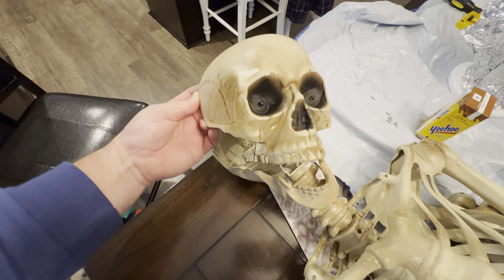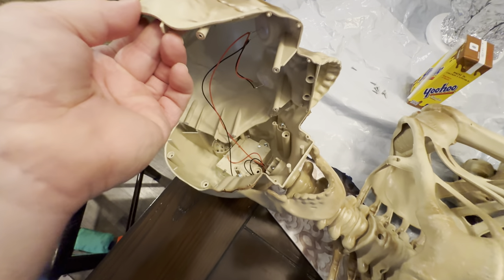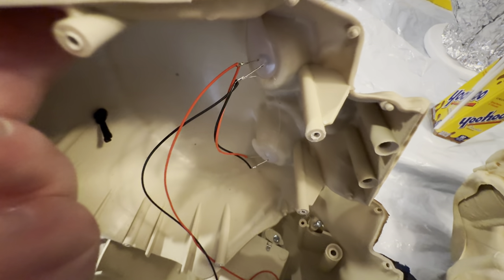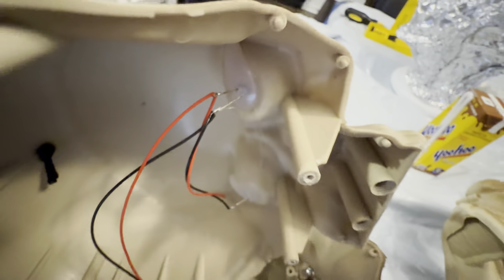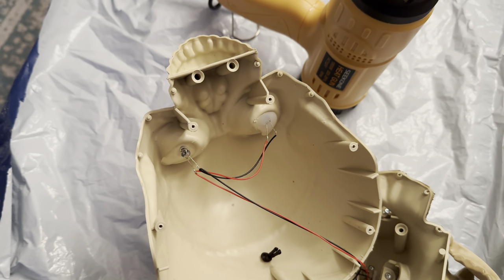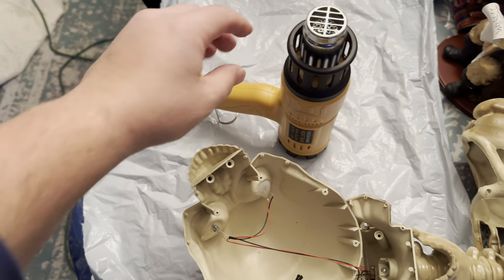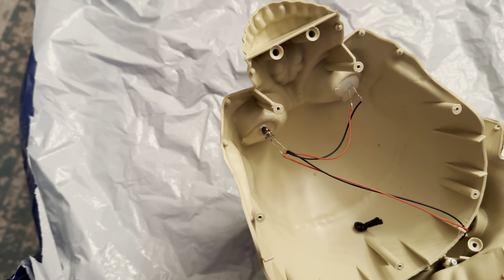Let's flip this thing over. I got those seven screws off the back of this skeleton skull. We can see that there's a couple of wires back there that hold these two LED lights together, held into the sockets with just some hot glue. I'm going to pop all this stuff out. I've got my heat gun so I can heat up these eye sockets and soften the hot glue to pull these LED lights out. Let's turn this on — it doesn't take much heat at all. Look at that, came out quite nicely.